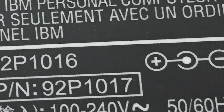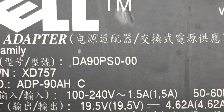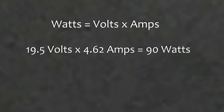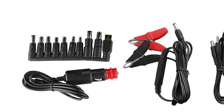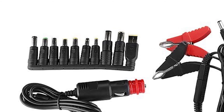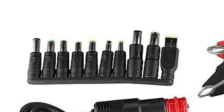While the panel is rated at 60 watts, which is enough to power many laptops, some require 90 watts or even 120 watts. Also, the 60-watt rating is for peak power in ideal conditions. Any dust or dirt on the panels, cloud in the sky, other obstructions, or even a less than ideal angle will quickly degrade the output. Many devices will not deal well with being underpowered and it may cause damage. This is not a flaw in the design of this solar panel, though including the various laptop adapters may have been a step too far.